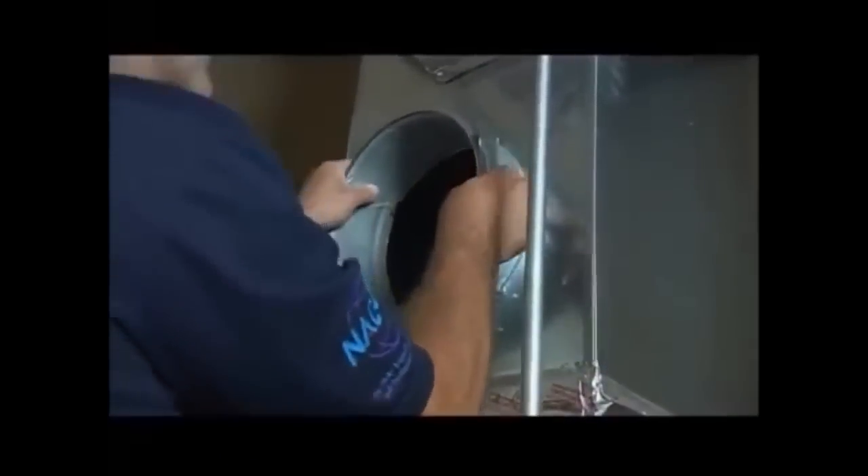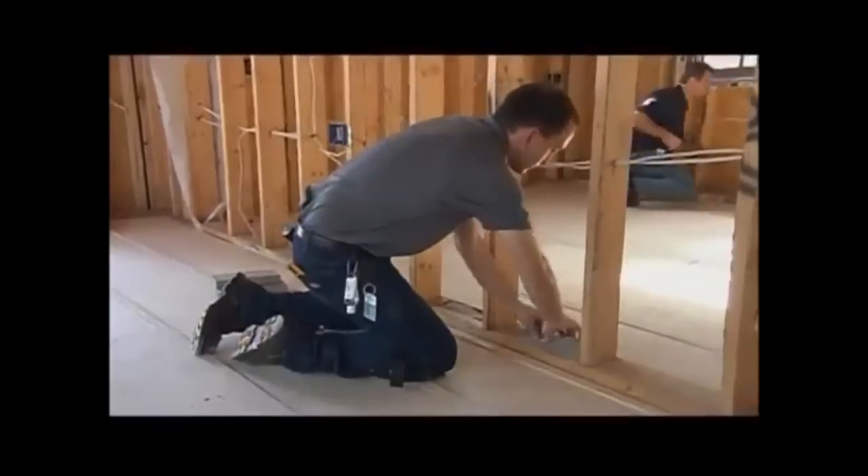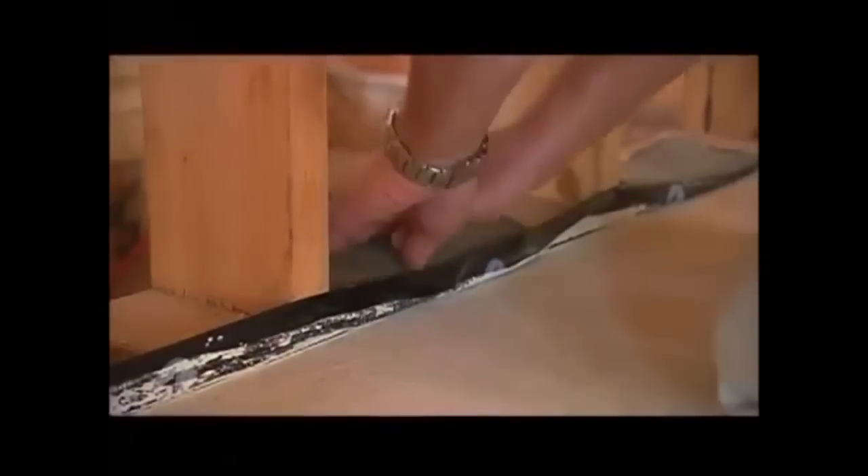You have a hole cut in the furnace. How do you go about connecting up? Once we've cut our holes in the ductwork, we mount some collars into the ductwork and hook up the tube from the machine through a Y splitter. From that Y, it gets attached to those collars and that's where we pump the air into the duct system. This isn't just for new construction — it's for existing homes as well. Duct systems leak 25 to 40 percent whether it's 80 years old or eight days old. It's the same exact types of problems.